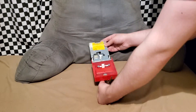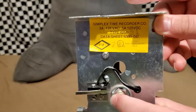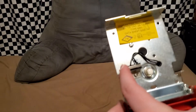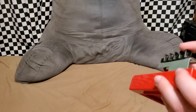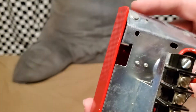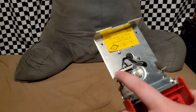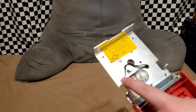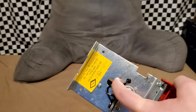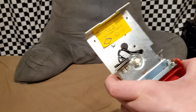Oh yeah, there we go. You can see in there 4251-31. There's your alarm switch, and then there's also this little toggle switch over here. I actually do not know what this toggle switch has a purpose of, other than possibly being like some type of anti-tamper switch. But there is no area in there for that switch to hit in order to be like an anti-tamper device. So unless this could be possibly like a general alarm contact — which if it is, it's not a very good design, because usually they would have a general alarm key switch up here for that purpose. I'll have to do a little more research and try to figure that one out.